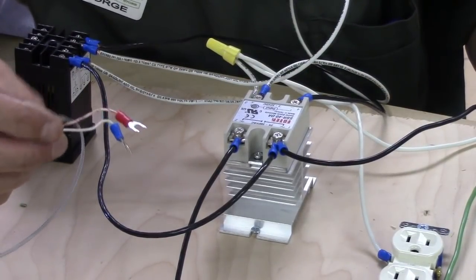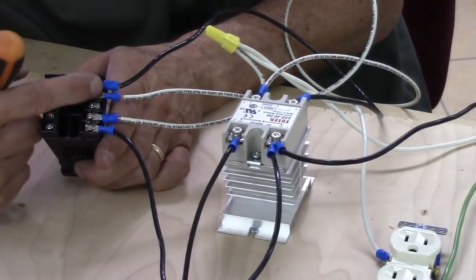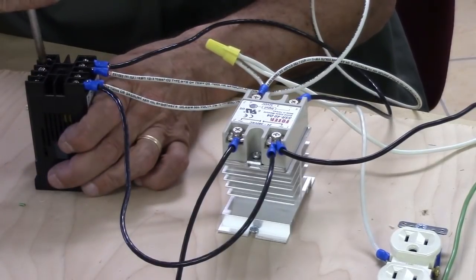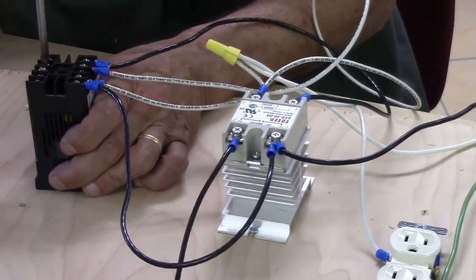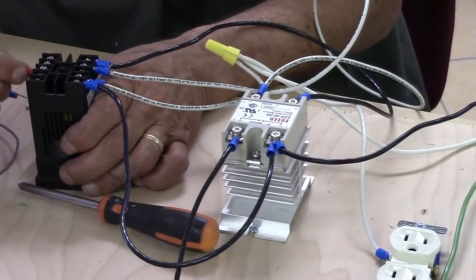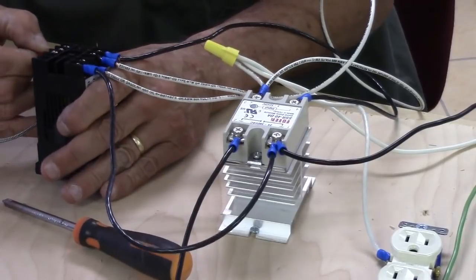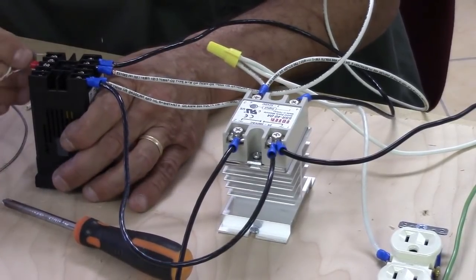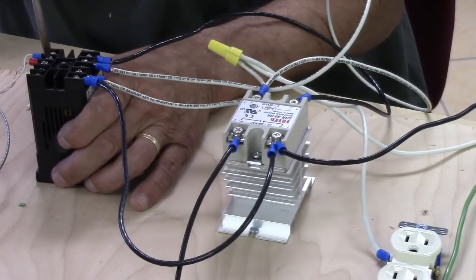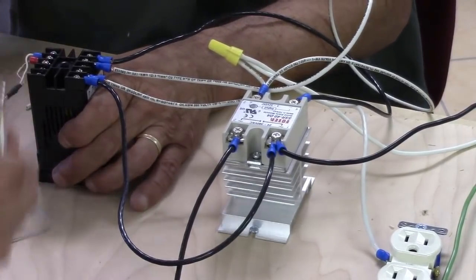There's one wire left — the positive from the PID to the positive pin on the relay. Now we've got pins one and two done, pins four and five done. The only thing left is the sensor. The thermocouple goes on pins nine and ten — they're also polarized so you have to put them on the right way. Count up: one, two, three, four, five, six, seven, eight, nine, ten. Unscrew pins nine and ten to give yourself a little room so you can slide your connectors under the screws. Connect pin nine and pin ten — that's your thermocouple. What that does is measure the resistance in your thermocouple, which is translated into a temperature inside your PID.